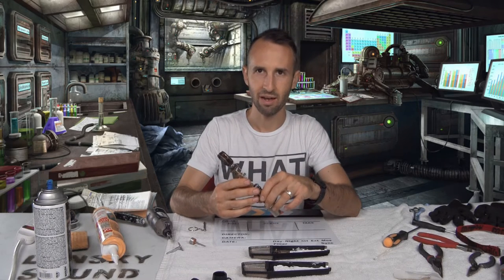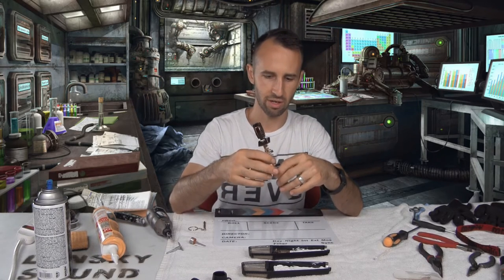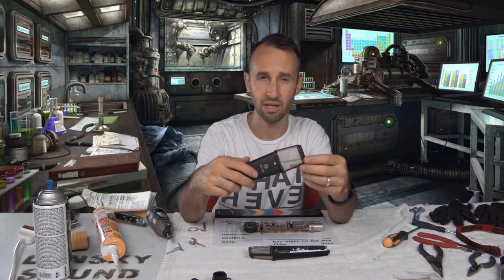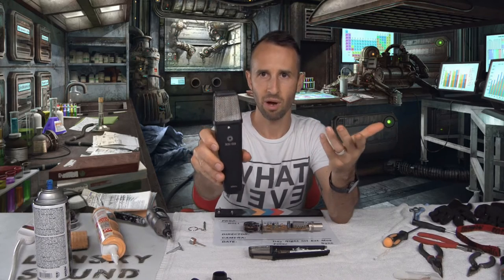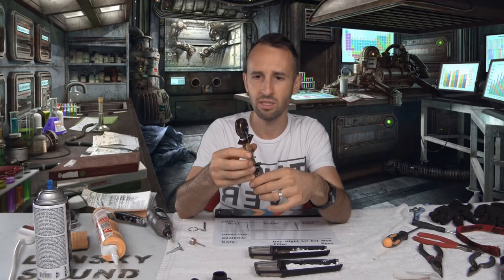After much deliberation, I have decided to remove the resonator discs from the front and back. The reason that I believe the resonator disc is incorporated into this design is because of the dark coloration from the original grille that was on the front and back of the casings. I think that the resonator disc, designed to provide a high frequency boost, was a method of compensating for a loss of brightness because of so much head basket reflection. But now that large grille is removed from our microphone, I see no reason to really have a high-end lift on it anymore. And from what I've read online, removing it smooths out the high frequencies a little bit, and I'm cool with that.